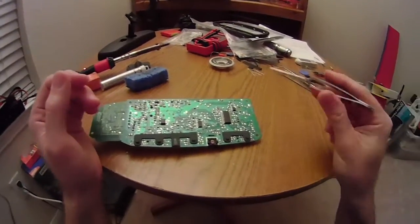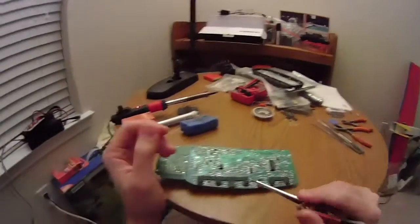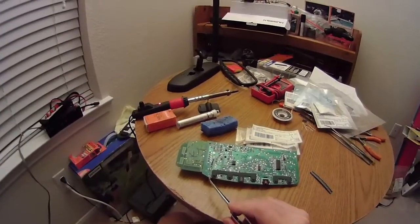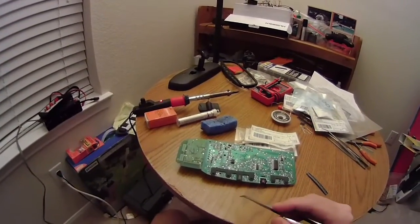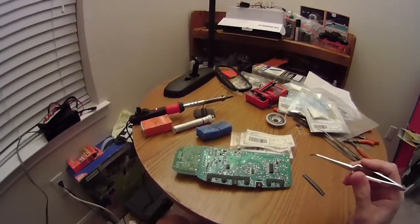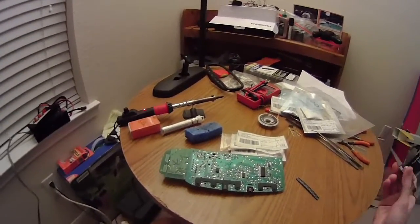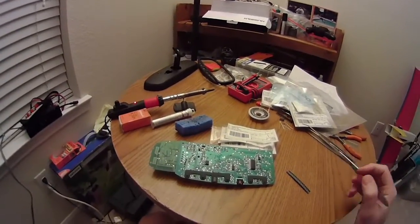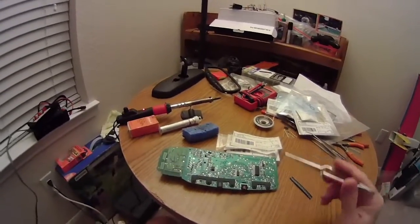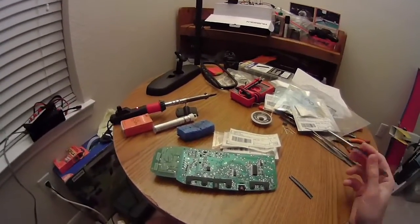I tested this with some large LEDs. The LEDs are placed 2 in series, and there are 5 pairs of 2 in series — so essentially 10 LEDs total to light the buttons, arranged 2 in series across 5 banks of 2 in parallel.